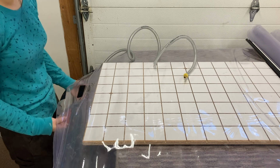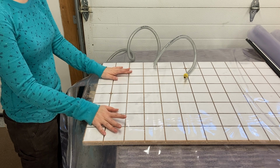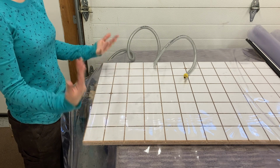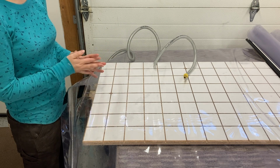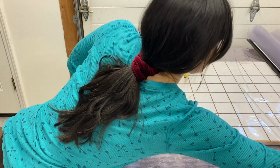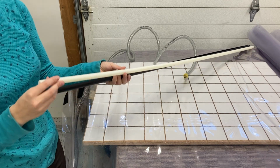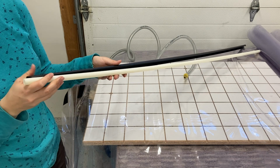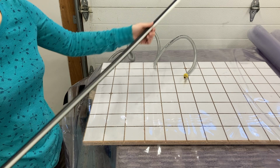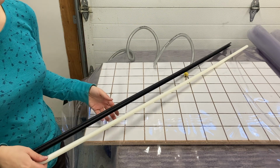But as you can see, I've centered my platen in the bag. Because this bag is 4x8 feet, which is kind of overkill, I've folded the bag in half and basically created a 4 foot by 4 foot bag instead. And then the bag is closed with what are called C-clamp closures. All it is is a tube of plastic with a C-shaped piece of plastic that clamps onto that inner tube. And basically the vacuum is sealed with a press fit.